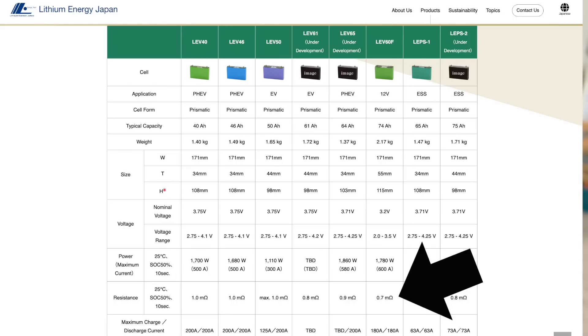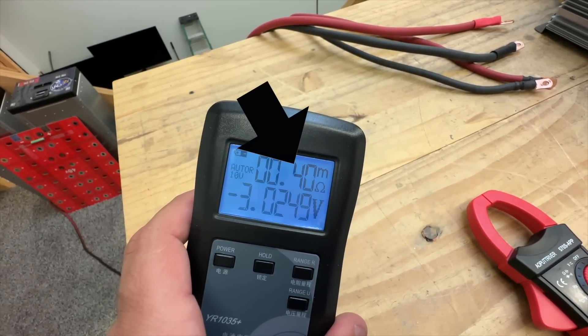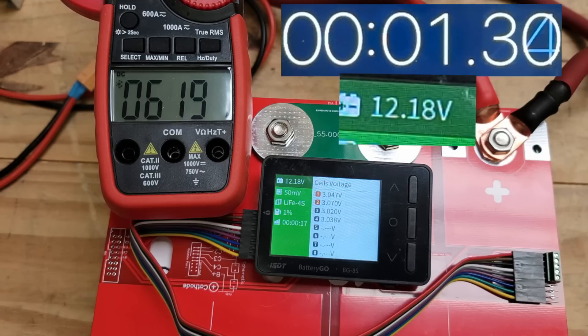The manufacturer's claims that these can do 600 amps for 10 seconds are correct. I took the best four cells out of eight — a couple of them had higher internal resistance, closer to the manufacturer's spec of 0.7 milli-ohms. The better-reading cells gave me confidence this test was possible. This test was far from optimal though — my loads took 17 seconds to reach 600 amps, with the battery pushing 400–500 amps along the way.